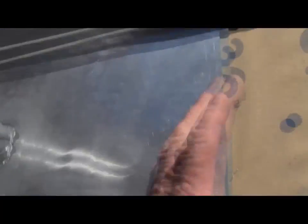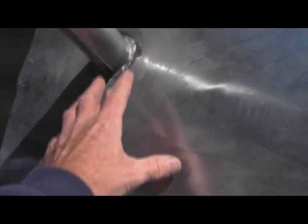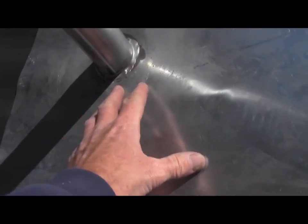Now what's going to happen is the next panel is coming down — it's going to have a hole in it so it sets down over this. And even though they get caulked on top so it looks very finished and waterproof, this is what the real protection is. This is actually going to catch water between the pans, allowing it to run on down.